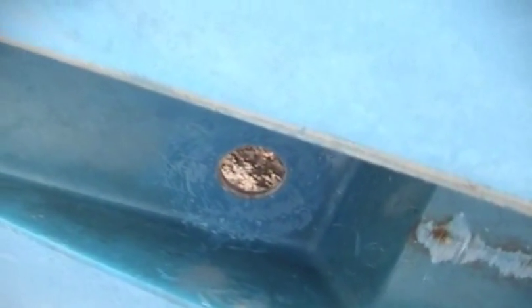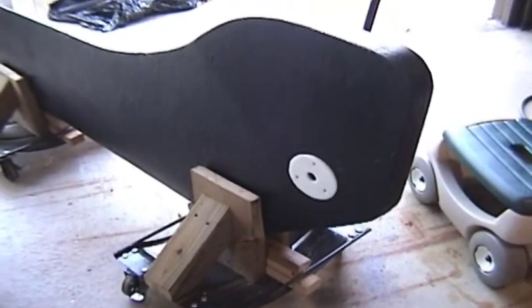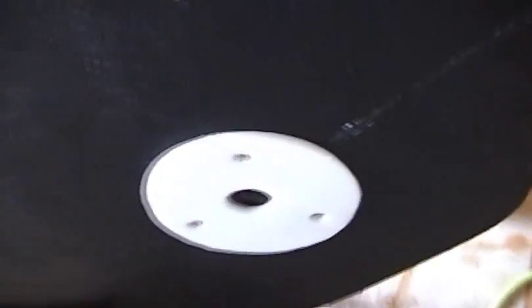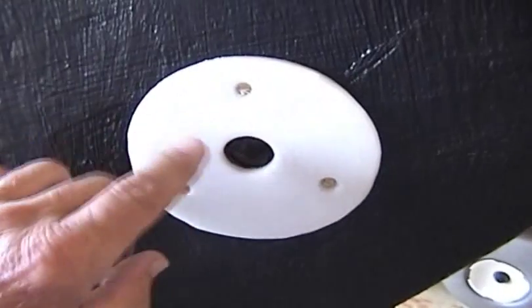I removed the through-hull to check it out and I thought it was plastic but it's actually bronze. It had a little wear on one side so I'm going to turn it 180 degrees when I put it back and it looks like it will go for another 36 years. Hoping to get the keel back in next week and everything completed. After I coated the keel and it's all cured, I put a high-density polyethylene quarter-inch plate on the side where the keel pin goes through to take up some of that slack. It's three inches between the plates.